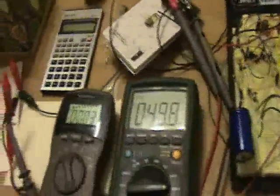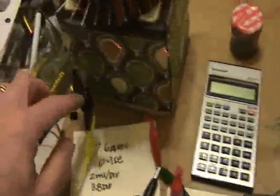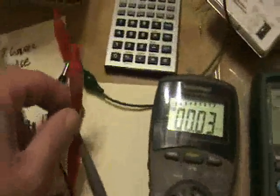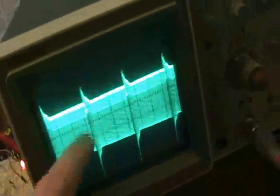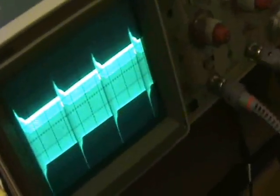If I put my hand over the coil, you can actually make this kind of wiggle. It was pointed out that the oscilloscope is pretty close — only two feet away — and the power supply in here has a huge magnetic field that's possibly being received by this. Also, the scope probes are connected on the side that is pinging the coil, and we see a ring on that side as well, which is subject to these fields.